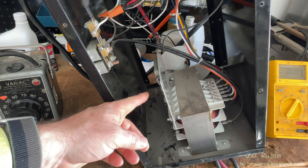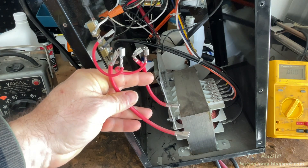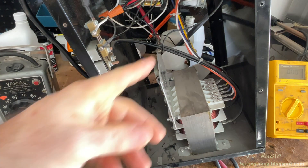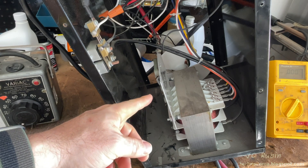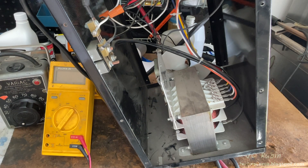Given you had a machine with the same symptoms and didn't let the transformer run blown up, power-off troubleshooting has already gotten us past the transformer — we know we're at the rectifiers. Now we're able to test them and continue with power-off troubleshooting. We'll turn our meter to the diode setting to begin our test.